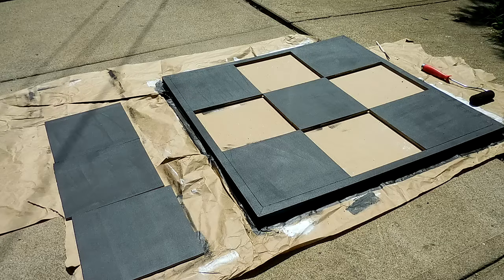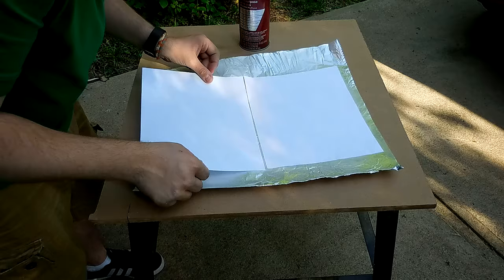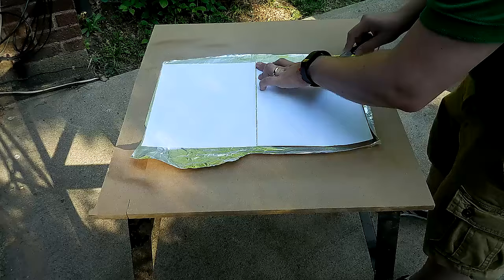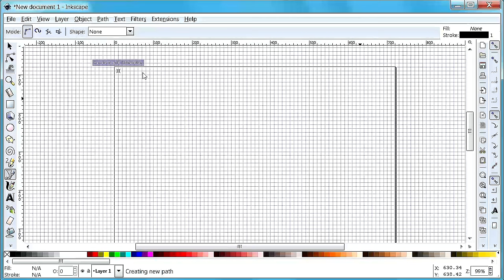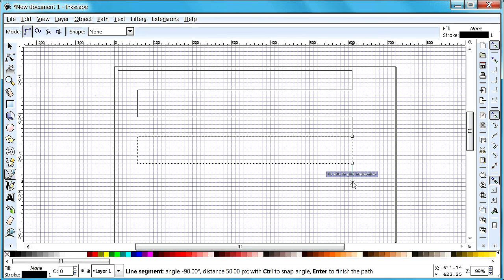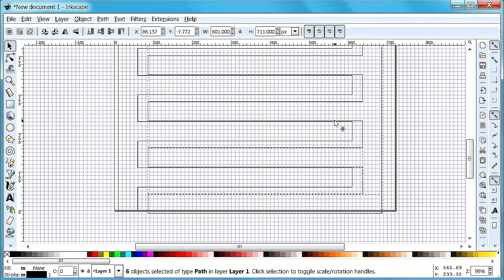With the paint drying, it was now time to make the button contact plates out of aluminum foil. I first attached the foil to a sheet of paper using spray adhesive. The paper adds structural integrity to the foil and acts as a backing sheet when the contact plates are cut out. After gluing the paper to the foil and cutting the paper-backed portions out with an exacto knife, I flattened the foil with my hand to make sure the entire foil surface had bonded with the paper. The shape of the contact plates was designed using Inkscape, a free vector editing program available at inkscape.org. To ensure that the third connection plate electrically bridges the two contacts regardless of where the panel is stepped on, the contacts have an interlocking comb-like design, which is commonly used in modern-day gamepads.